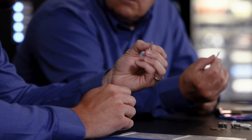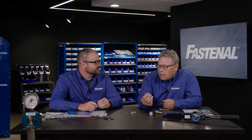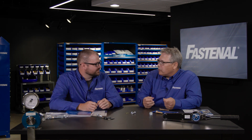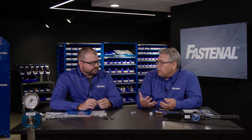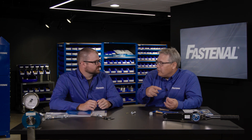We know we're going to pierce that sheet metal, and we use these spaced-out threads to just almost hang off of that thinner gauge sheet metal. So we're not really developing a clamp load — we're just hanging on. If we hang on too tightly or pull too tightly, we'll pull it right through the sheet metal. There are also points that have cutouts and lines — features of a tap where we're cutting threads and actually removing material.